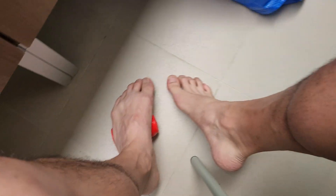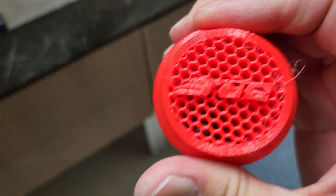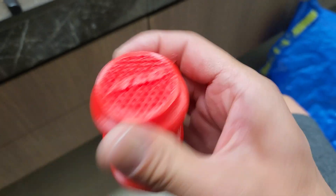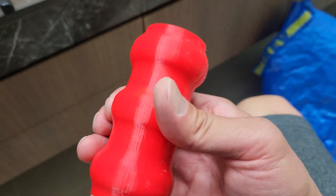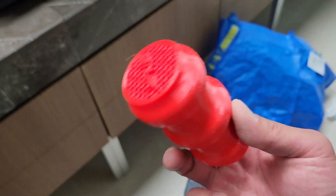I'm actually going to test all of these here in South Korea — it's kind of hard to ship them to the US if I print a bunch of them. With TPU you can really control the strength using the infill percentage. This is about 25% infill and it's very firm even under full body weight, but soft enough to give a much better roll than a hard plastic like PETG. You can roll it easily on hard surfaces like these tiles, and TPU won't break.